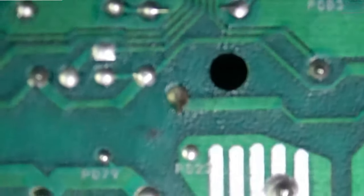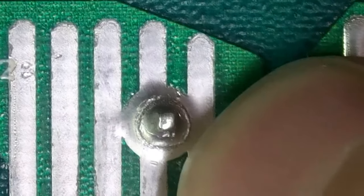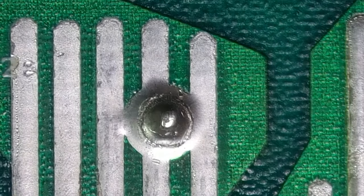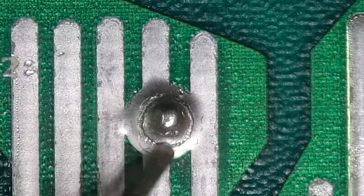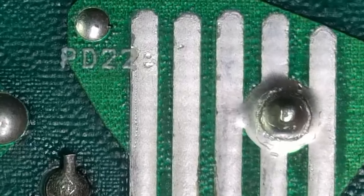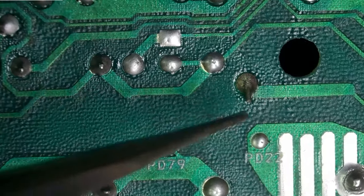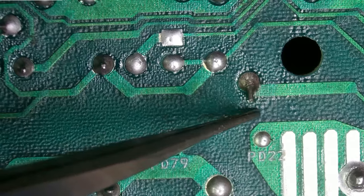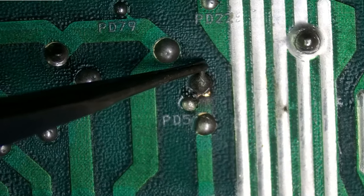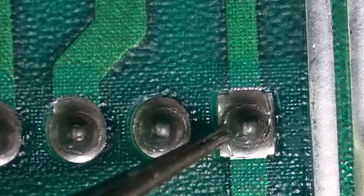A few things I want to show you are cracked solder joints. Over here is the backside of our relay — we have a crack forming around the joint. You can tell right here there's a little ring. If we look at a good joint like this one, there's no ring. This one has a ring, and I noticed that in a few other areas. This is the back of our resistor, and as you can tell, it's kind of loose. Over here is the other leg, which connects to this pin.